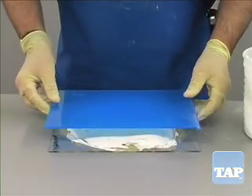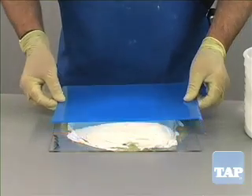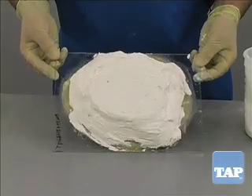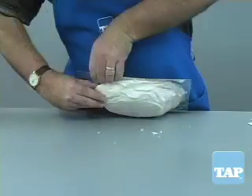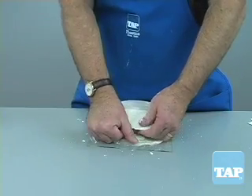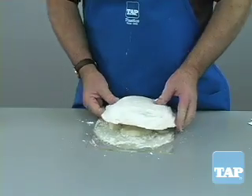To make casting easier, create a flat surface to rest the mold on by sliding a smooth board or piece of plastic across the back of the plaster. The plaster hardens in less than an hour and can be removed from the mold.